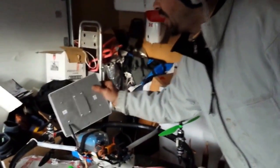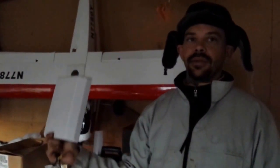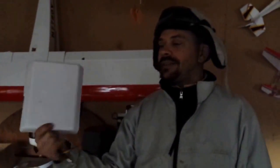So what's that one called? That's a bi-quad. And as an example, here is a 2.4 gig patch antenna, so this is a directional antenna. And if you had a whip antenna, like your standard rubber duck, they call them, just like what we see on your standard on board, you'd have a whip antenna like this, you'd have this pointed to it, and that would give you a very high gain. Mm-hmm. Okay, you have to make sure that you have the right, you can't point it backwards, it's not going to pick the signal up.